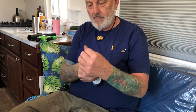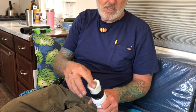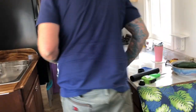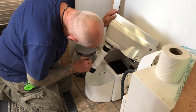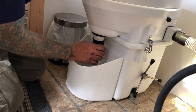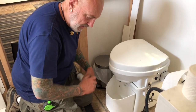So that'll go up to the toilet. What I did is I got a reducer — that guy is going to go in there, and the toilet had that little spout so it reduces down so the fitting can't slop around in the little spout. I'll just smooth this up with a piece of sandpaper on the flat surface to take the writing off so that rubber gasket can seal on there. I'll just take those threads out of there — that's too easy. You can buy that without the threads but the store I was at was a little limited.